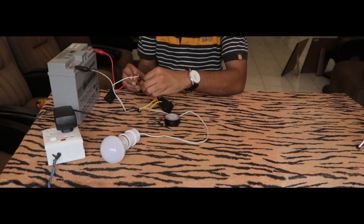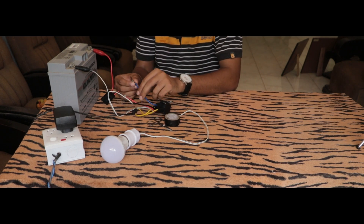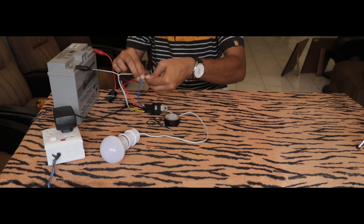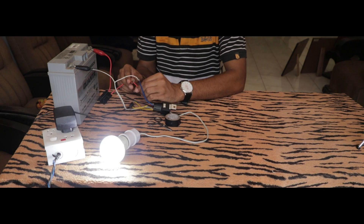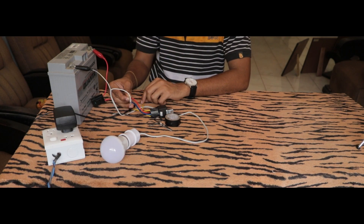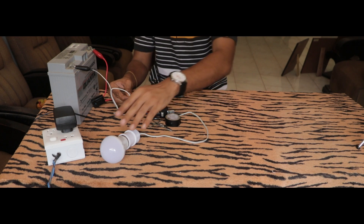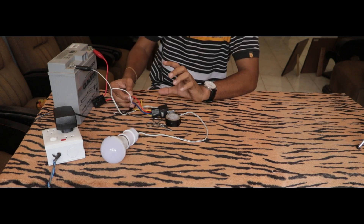You'll be left with one wire going to the bulb and one wire from the battery — just randomly connect these wires to see which has continuity when you give power to the relay. Connecting the red wire with the red wire from the battery — these two don't have contact. Trying the blue wire — this also doesn't work. Switching the white wire with the blue wire and powering the red wire: the bulb lights up. As soon as I disconnect power to the relay, the bulb goes off — meaning the relay is now acting as a four-pin relay. We do not want it wired this way.